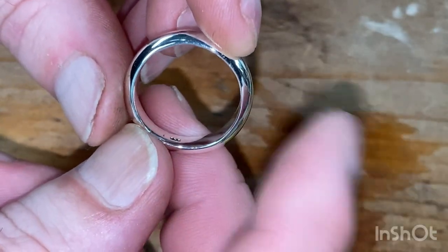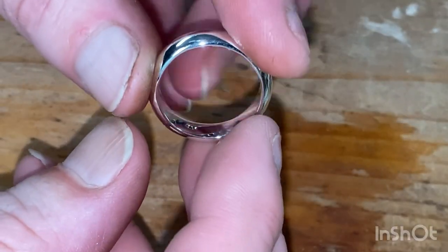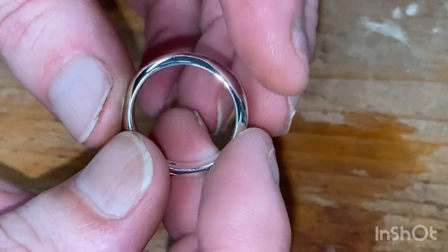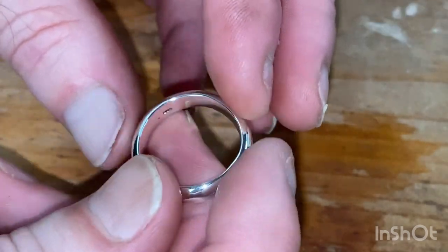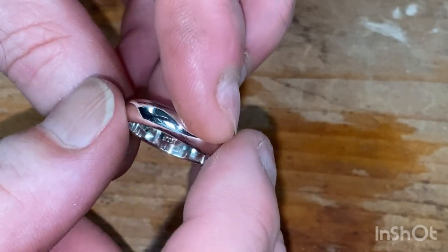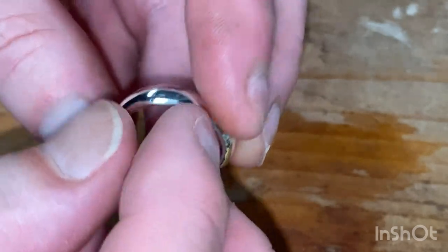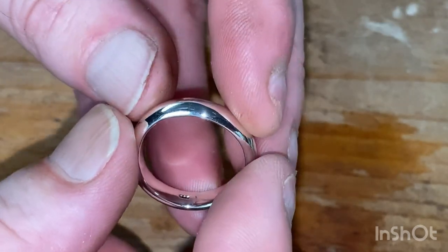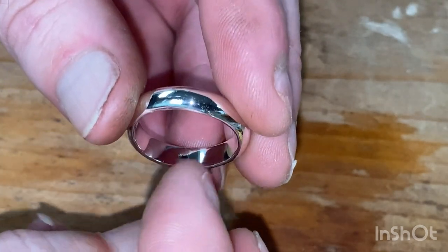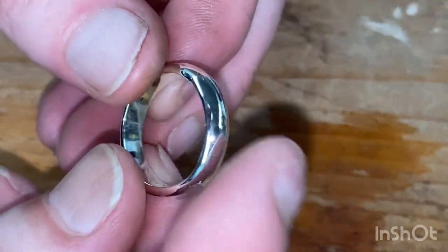And from there you'll go, oh, okay, if I can do this, that, and the other with this, when I do it to that, just take into account it's a lot thinner, it's a lot thicker. You know, making sure you anneal things, just be delicate with the delicate things. And yeah, when you progress, you'll get onto understanding why there's more than one type of solder. So when you start doing a build up, unless you can jigsaw it together nicely to have it all in hard solder, which I like to do, then you can move to medium and soft. So anyway, that's another lesson for another day.